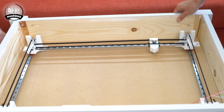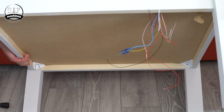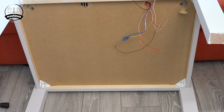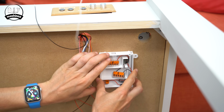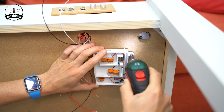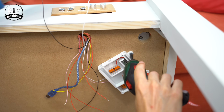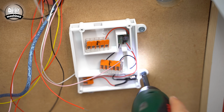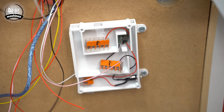Now is a good time to fix this to the underside of our table frame. Make sure you remove the LED frame and 3mm baseboard with sand before you carefully place your table on its side with the control panel facing upwards. Use 3 wood screws to install it towards the top right of our base so that the barrel connector is on the right and the buck converter towards the top right.